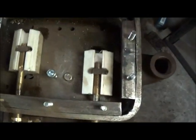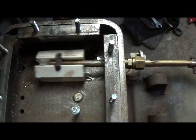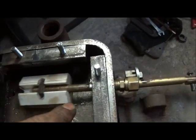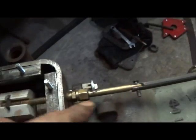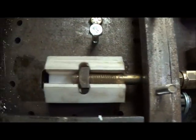You can see how everything works — the eccentric, the linkage. I've got just about all that done. I'll try to get it slowed down a little bit where you can see. I know I need one of them adjusted and I think it's this one here. You can see it's uncovering this valve a lot farther than it's uncovering that one. I haven't adjusted it much, but I can do that from right here. I don't have to put a set screw in that nut like I did on the last one, because I've got it pinned. This one looks like it's going real good — totally uncovering the front hole and uncovering the back hole. That's how it's going to work.